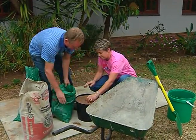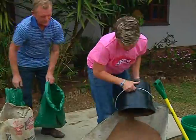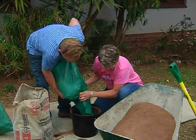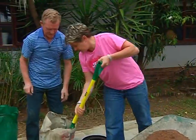And we're using a fine plaster sand here, Garth. Could people use a fine river sand as well? I wouldn't recommend a river sand for under the smart tiles, Tanya. Okay. Because the smart tile is so thin, that's why we're going with the plaster sand. That's correct, yeah. Okay, excellent. And then we're doing one cement. One cement. Okay.